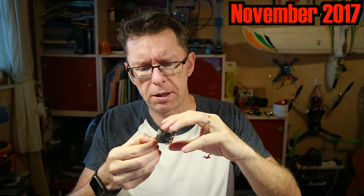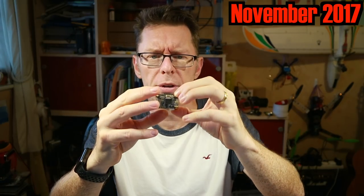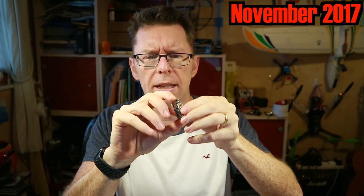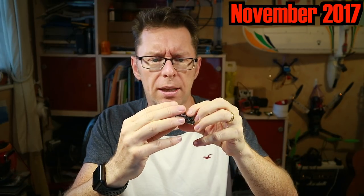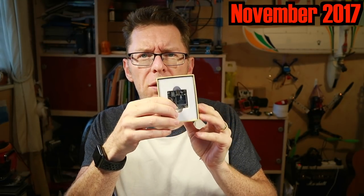Hello, and today a few new products from our friends at AKK Tech. This time they've brought out their own F4 Omnibus flight controller. This is essentially equivalent to the F4 Pro — it's got a current sensor connection, onboard SD card, and all the rest of the various features of the Omnibus boards, mainly the on-screen display which is really handy. And to go with that they've brought out their brand new VTX, this is the F2.